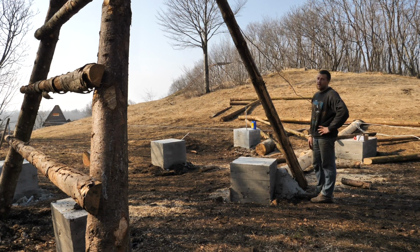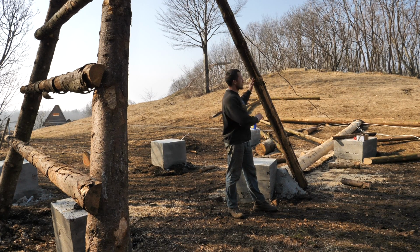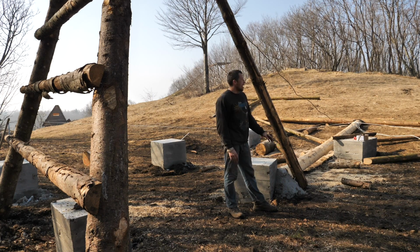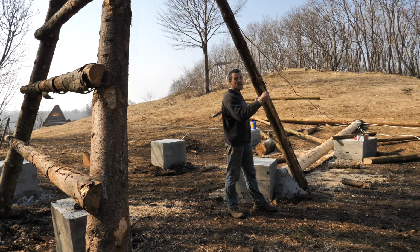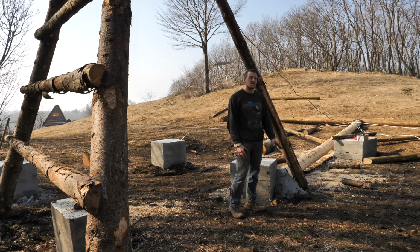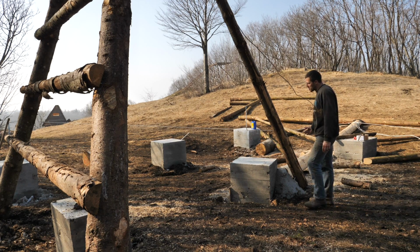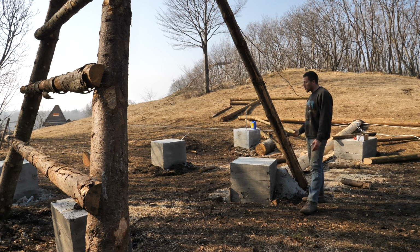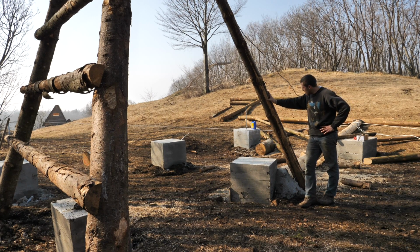and how I will be lifting logs up to the walls. There are a few things that I'm worried about, because there is just one log. As I'm lifting it, it could swing to either side. I attach the rope and the pulley on both ends so I can tie it up and hopefully it will stay in the center. The other thing that I'm worried about is at the beginning there will be a lot of force also pushing in this block, and I hope it won't move and go out of place. I'm not worried about this triangle with the pulley breaking or anything. The logs are really big and I think it's pretty strong.